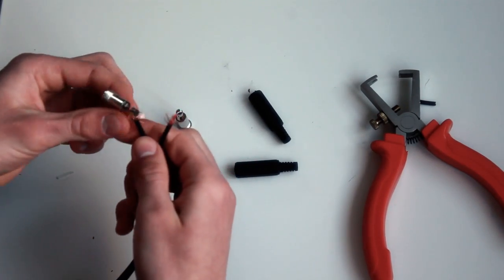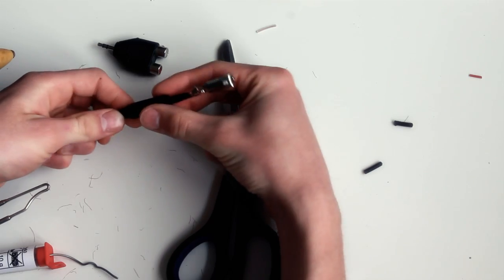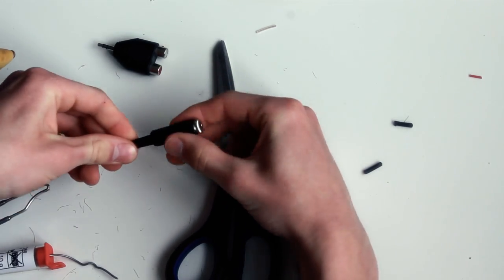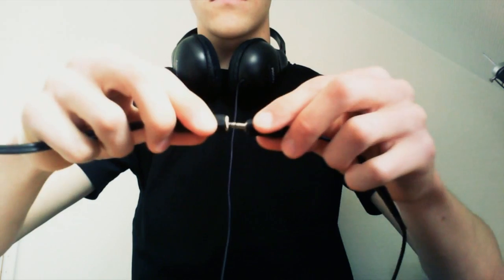For some more money you could also buy a finished cable, but I decided to solder it myself. I simply connected the three wires on one side to the other side and attached the jackets. Finished! Five minutes of soldering — and my soldering skills are very bad. So now we can plug our RCA adapter to our 3.5mm cable and with this we can connect the RCA output of our camera to headphone jacks.